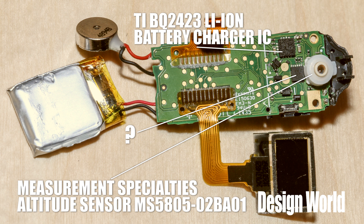We generally use markings on the chips to figure out what they are, but in this case the markings aren't definitive — all we have are clues to its identity. One of those clues is that the chip sits super close to the altitude sensor, so it can easily have something to do with altitude sensor readings. Also, a close look at the circuit board reveals there's a connection from the chip to the side button that you push for getting readings. There's another connection from the chip to the TI battery charger IC. So you might conclude our mystery chip probably has something to do with the readouts of the altitude sensor.